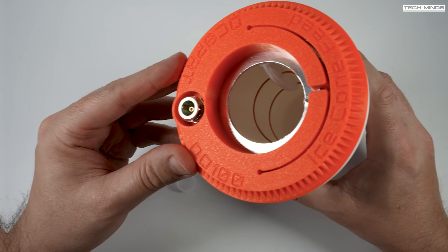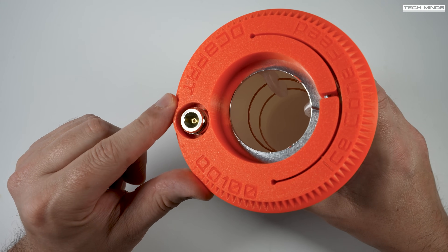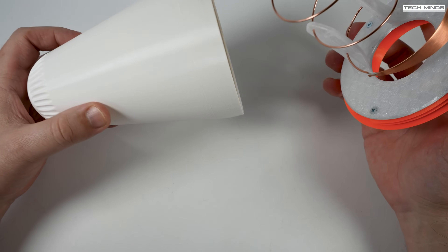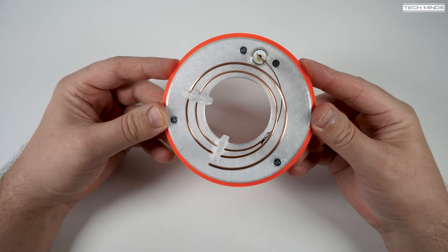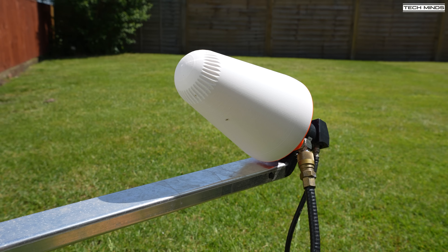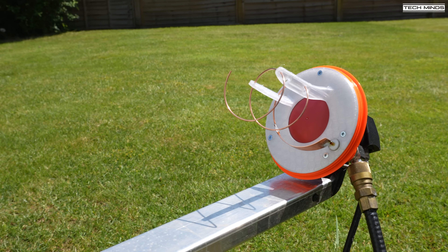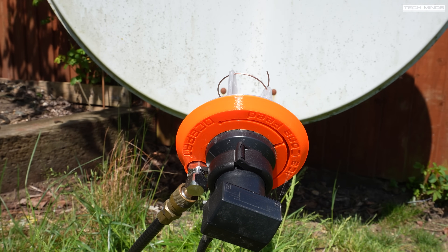The reason we need an antenna like this — with a helix tuned for 2.4 GHz and an LNB in the middle — is because QO-100 transmits its signal on 10 GHz but receives on 2.4 GHz. Using a dual-feed antenna like this, we can receive the 10 GHz signal using the LNB, which down-converts it to a more manageable 750 MHz, and the helix copper coil is used to transmit our signal to QO-100 on 2.4 GHz. This saves having two separate dishes. Version 2.1 is 3D printed from PETG material, which is UV resistant — great for leaving attached in all weathers.